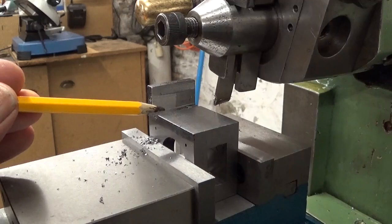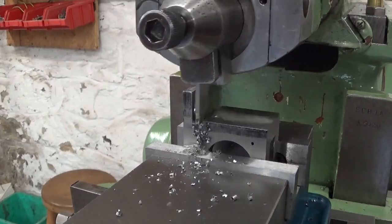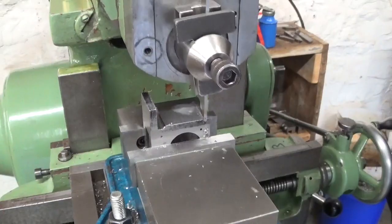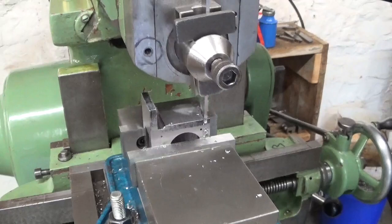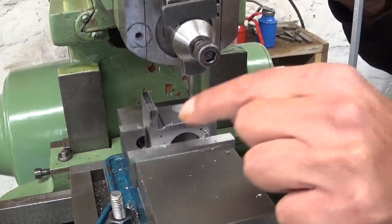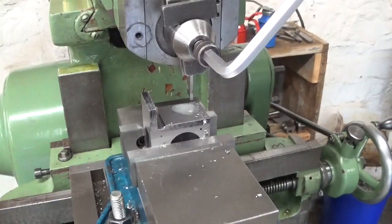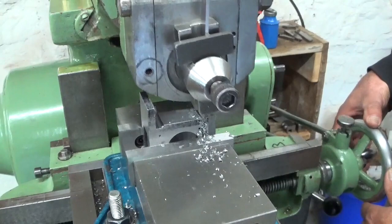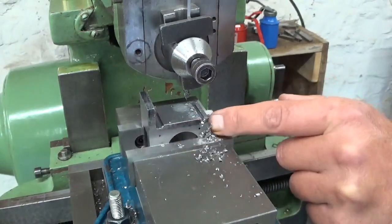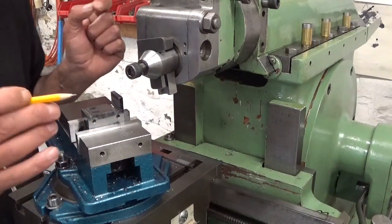Right, I'm gonna set the angle back at 0 and make a straight line here in the bottom. I'm gonna shorten the tool. There's way too much tool stick out to do this side. For here it wasn't possible the other way, but here I can make a very short one. Will be much more rigid. Alright, these two slots are cut, finished. No touch anymore, well, clean up with a file.